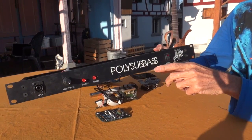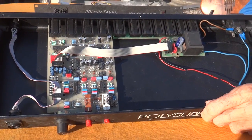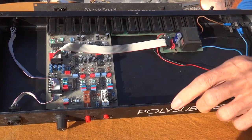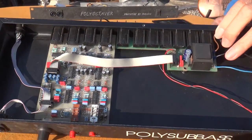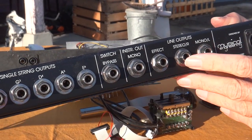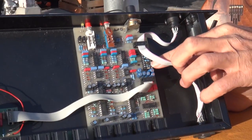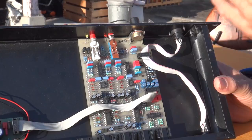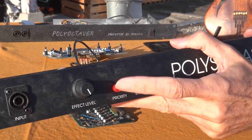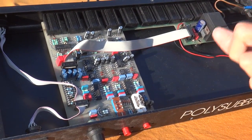So we gave up on the name Polyoctaver and called it Polysubbass. This machine was made about 300 times during 20 years or so. It does the same effect on three strings and also has outputs for each string, separate for the bass effect. There is also a stereo mixing thing in here where with resistors you can define how you want each string to be spread between left and right. And there is a priority switch here — it activates a circuit that detects which string is the lowest played, because we found out that it's not nice to have two bass notes.